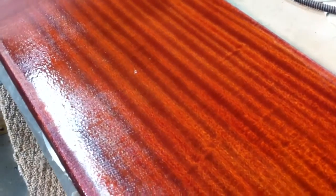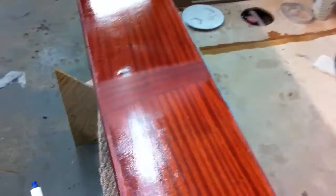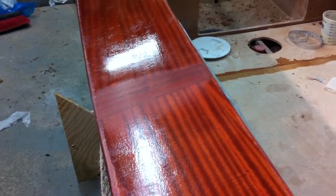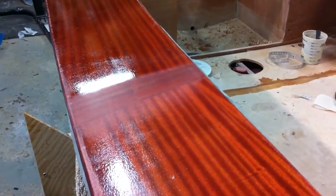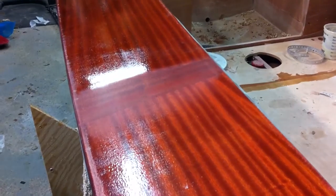This is the top deck of the boat I'm working on — it's plywood, a stitch and glue boat. I've applied a four-ounce cloth, which you can see dangling over the edge, wetted out with West System epoxy using 105 base and 207 special clear hardener. That hardener was selected because it's designed for bright finish work where you need a very clear, transparent, and blush-free result.